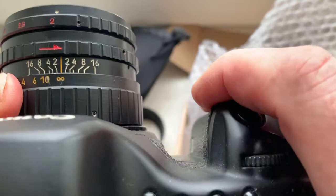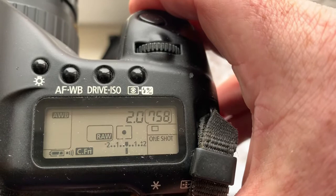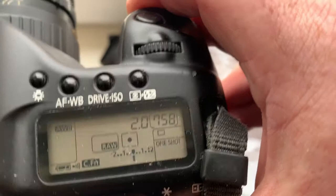Look, I pre-programmed focal length to 58 millimeter, aperture 2.8. Delay time to enter programming mode is one second. You can always reprogram the chip from our programming instruction.